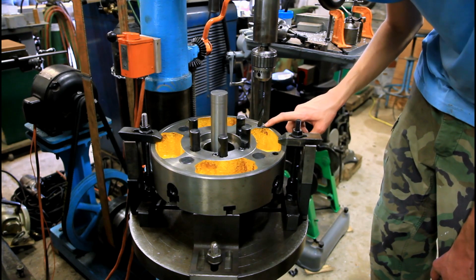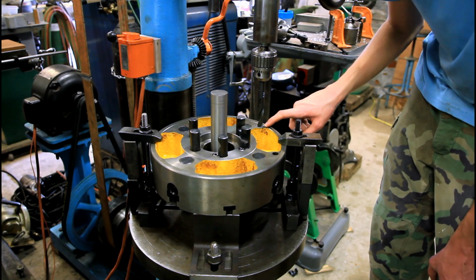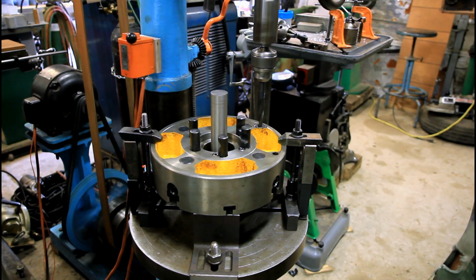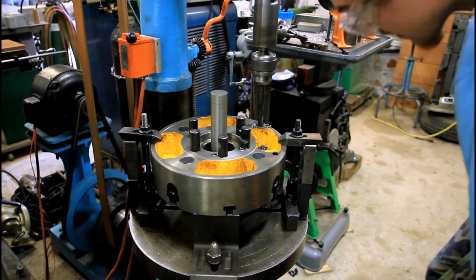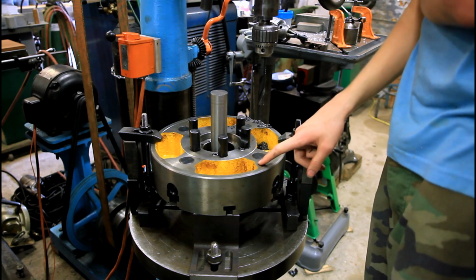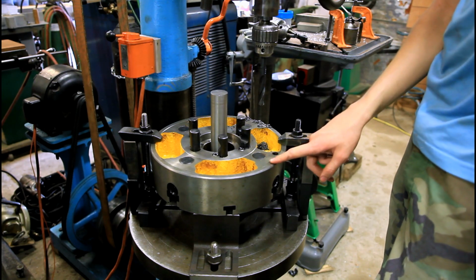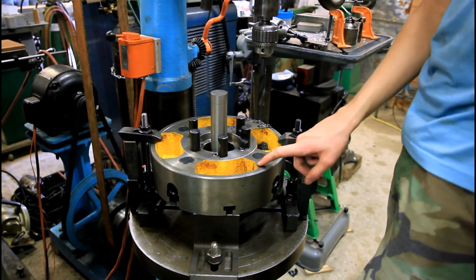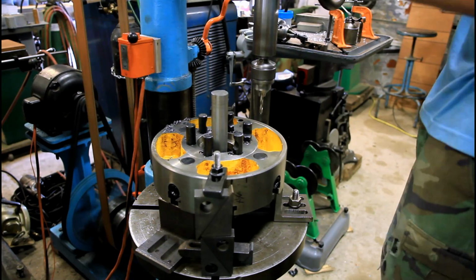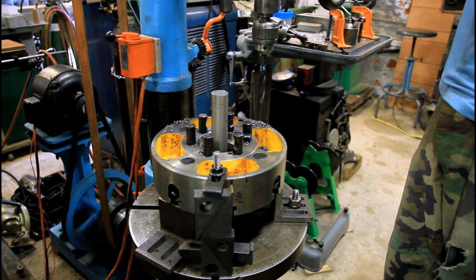Instead of letting the drill fully establish or starting the depth with it just touching, I went to about halfway in between. Alright, so I put the first hole here. I think I'll put the second one here. I might should check first. But I think I'll go ahead and put it there. Okay, now I gotta vacuum all the chips out and we'll check it on the balancer.